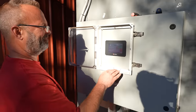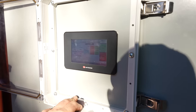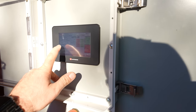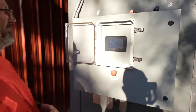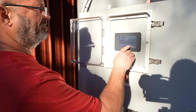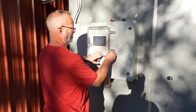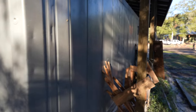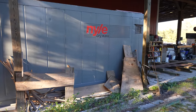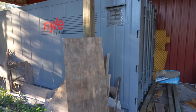Now that Dad's set the kiln to hybrid mode and our settings are good to go, the dry bulb is at 63 and the wet bulb is at 50 — that's because it got cold last night, so it's going to take longer to get the dry bulb up to 125 degrees Fahrenheit inside the kiln. The doors are shut, Dad's going to start the kiln, hit the start button — it's going to ask to make sure everything is closed. There we go, the kiln's fired up. In about two to three days we'll come back, check the moisture content, switch it to DH mode, and this firewood will come out in about five days.